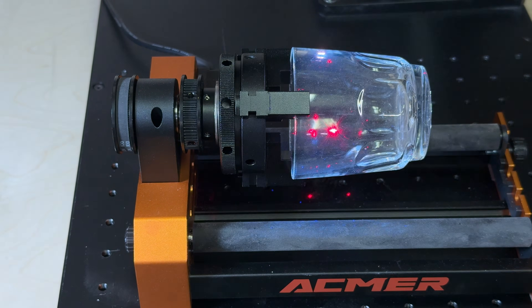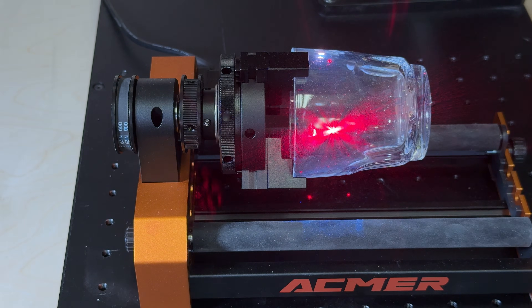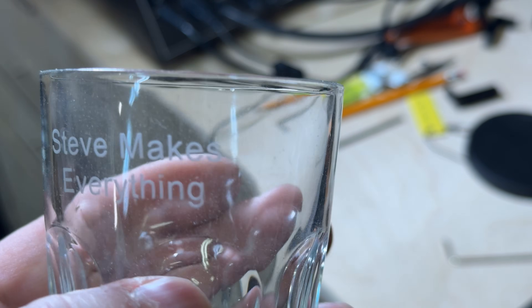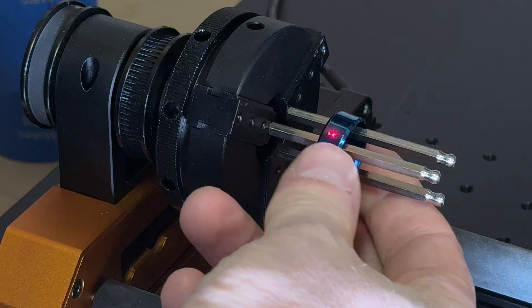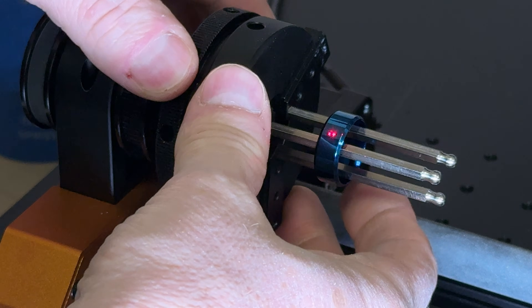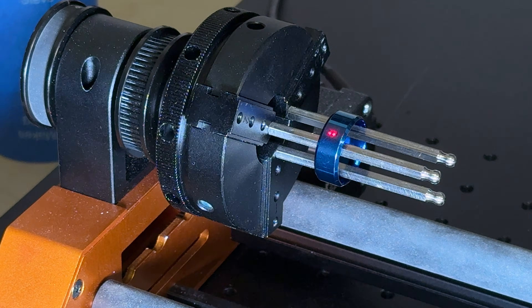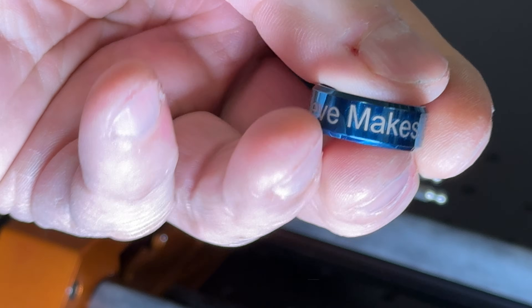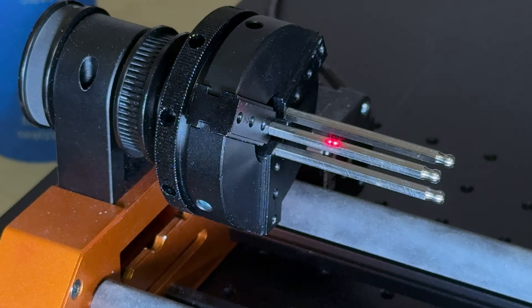Next I engraved a glass using a smaller 1mm split with single characters, and put my channel name on it — it came out great. That solves a lot of problems if you don't have a rotary with the Omni1, because Lightburn can only correct so much. Finally, something more challenging: I put a ring on the chuck using the chuck pins to tighten it on the inside of the ring, engraved my channel name, and got another awesome result. All in all, not only does the M4 work with the Omni1 — it works really well — and now I have a single rotary I can use in multiple places.